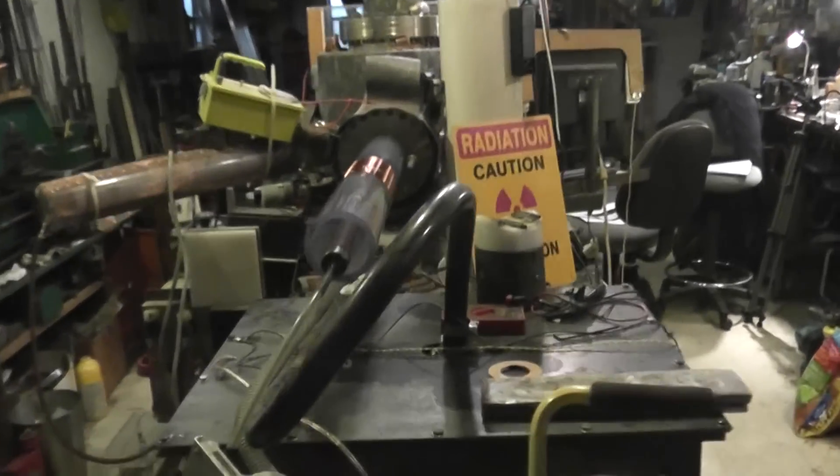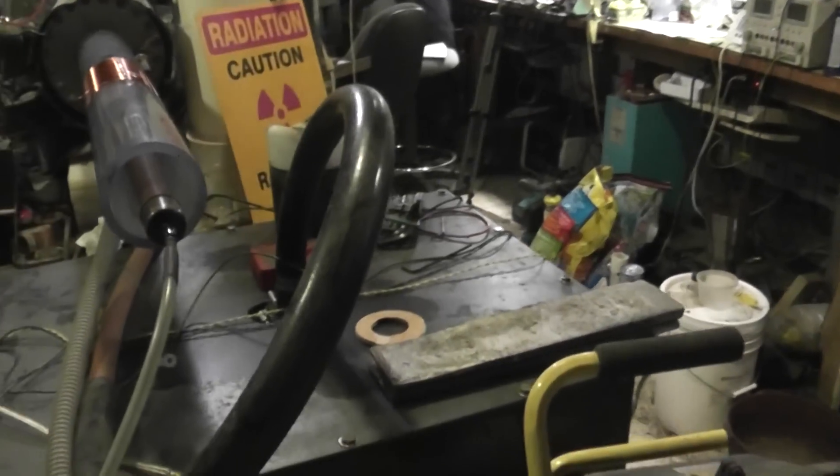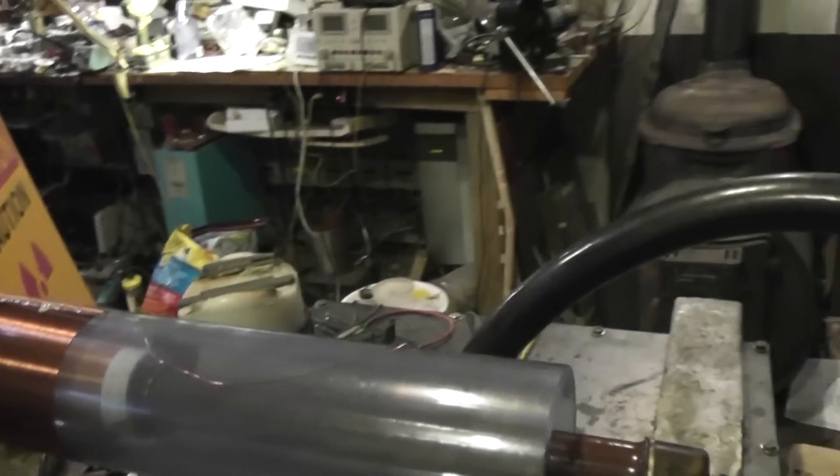Now all that stuff coming out of the feed-through and this wire coming in the end — our current power source is normally inside of this thing, which is a big old piece of PVC pipe with screen on it. And that just keeps RFI out of everything. So this is all really the center conductor of a fairly fancy piece of coax.